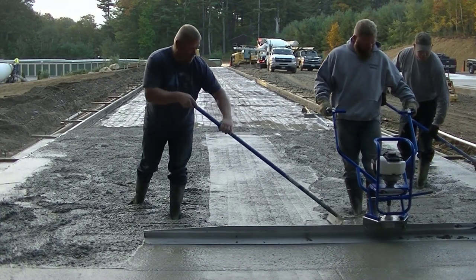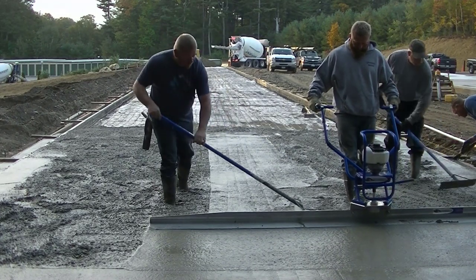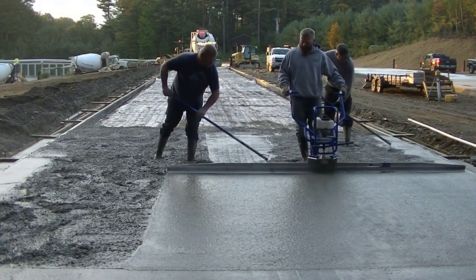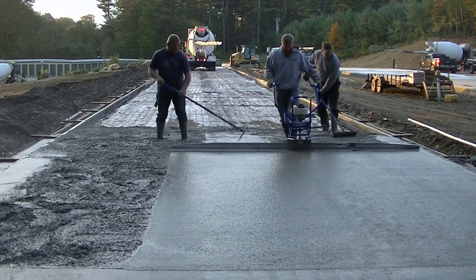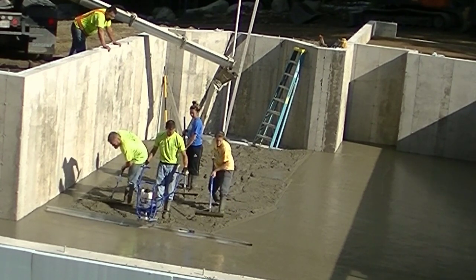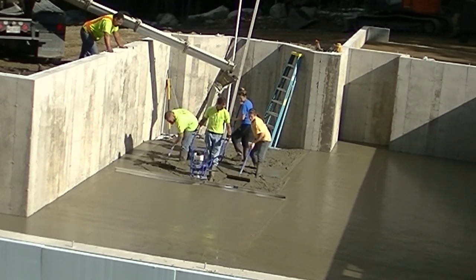We screed a lot of concrete with these power screeds. This is like a 4,400 square foot slab we're doing with the Shockwave and it was virtually effortless. No bending over, no kicking. Me, Luke, and Darren grew up being taught to hand screed everything — if you've seen my other videos you've seen kick screeding. You know how hard that can be. But you can see the effort Darren's putting into screeding — there's virtually hardly any effort at all, especially if you've got guys behind you with come-alongs and rakes. Here I'm down in a basement — about a 2,000 square foot basement — it takes about 45 minutes to an hour to pull one of these.